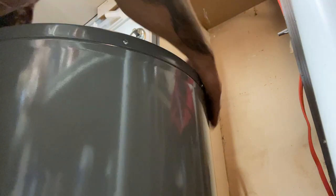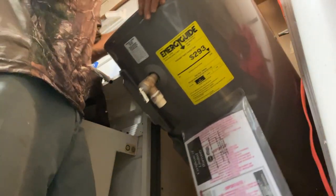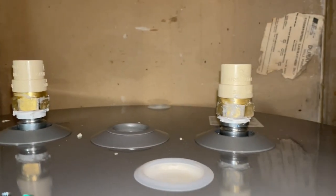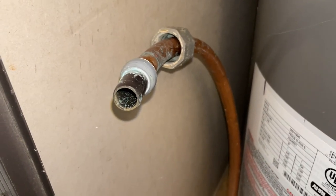Let's see if we can get this thing up in here. Oh, that's better — oh yeah, we like that. It now changes things because our overflow can go down to the original hole and we've got room to install an expansion tank, which I've already pre-charged to 53 pounds — which is the incoming city pressure at this house. Now to hook up those lines. I know you guys cringe, and it breaks my poor little heart to have to use shark bites on this pex right now, but I don't have a choice.